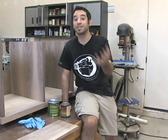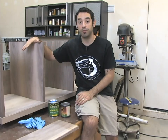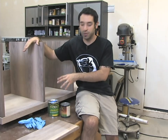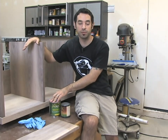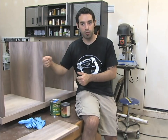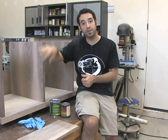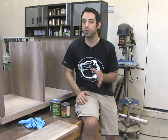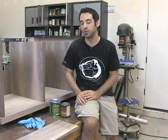You could even do this one step before — you could have everything pre-finished before we even do this part of the glue-up, but I like to have at least most of the joints protected from our finish before I even go into this. The other thing is the front sliding doors need to be mobile, and if you start applying finish to that surface, the finish is probably going to drip down into the channel that we've cut here and it's going to make it a lot harder for that door to slide.